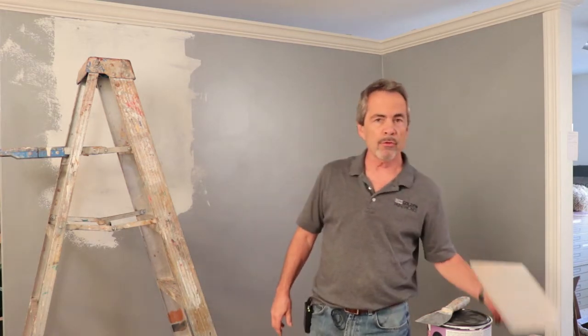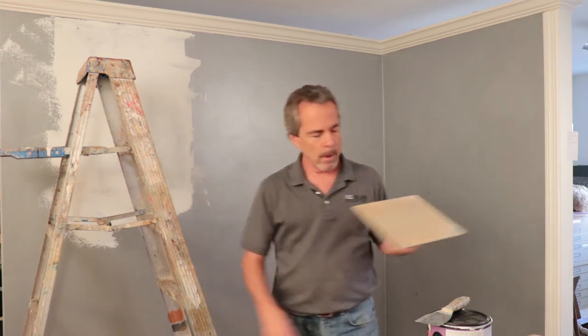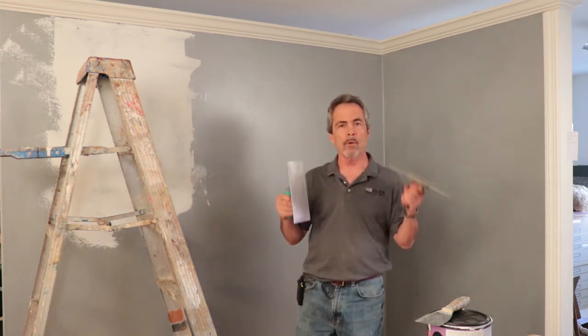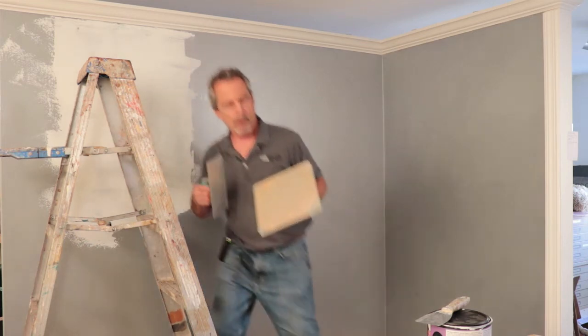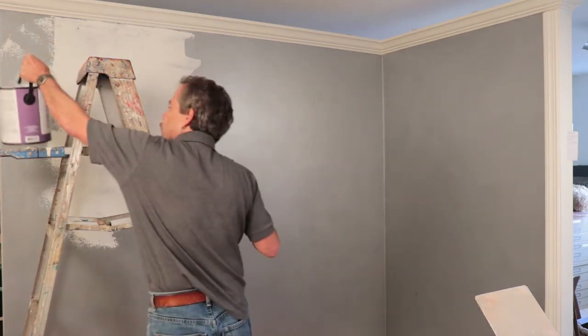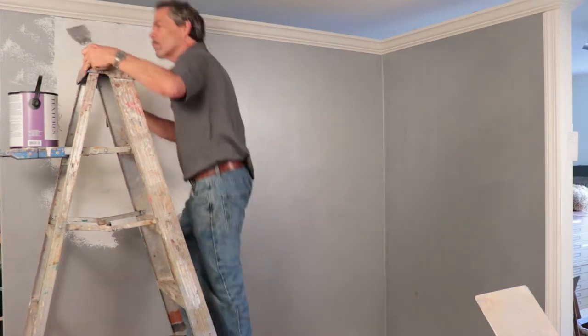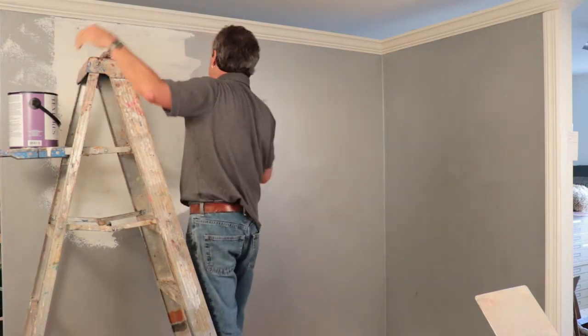I'd like to talk about the tools used to get material from the bucket to a wall. The traditional tool is a plasterer's hawk — this is the best way to get material from a bucket to a wall quickly. But I don't generally use a hawk for most jobs, especially when I'm working off a ladder. Working with a hawk requires two hands to hold each tool. When you're on a ladder, you need one free hand to hold onto the ladder — otherwise it's not safe. So I work with a hawk when I'm on scaffolding or a stable platform. Generally I work with a three-inch spackling knife directly out of a bucket on a tray on a ladder hook. That way I can feed my trowel with the material and still have a free hand.